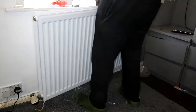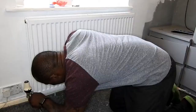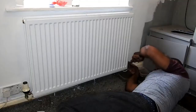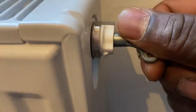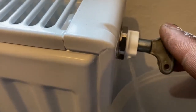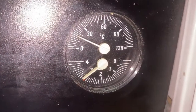Now that that's done I'm going to fit the radiator back on like so. All I've got to do now is connect these valves and just tighten them up with a spanner — and that's the other side. Then all I've got to do is open the valve, let the water in. You can see here it's all air coming out and then water will eventually come out — that's me bleeding the radiator. Once that's done I'll just go back down to the boiler and make sure the pressure is correct.